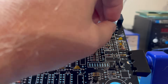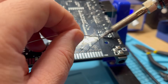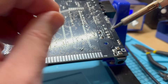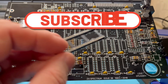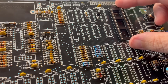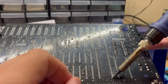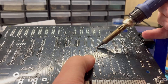The last piece of the power rail is the coil — we'll get this part in and then it's time for a quick cup of tea before we get on to the repetitive bit: the sockets. Here we are in socketville, and I'm using these turned pin sockets as usual. For those of you shouting 'why not use leaf sockets?' — you are in for a treat a little later in this video. With sockets I solder each diagonal corner first, then press each corner down while reflowing to get them nice and level.